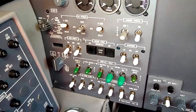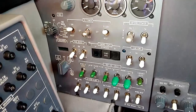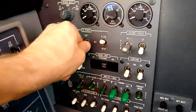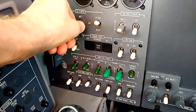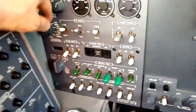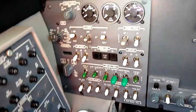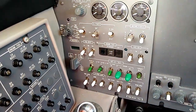That concludes the flow around the cockpit — setting up all the switches and what everything should look like for the first flight, or really at the start of any flight. After conducting that check and setup, we move to the pilot side control panel and check the emer bus. I have a separate video that goes into detail about checking the emer bus items. Then we turn the main battery master on and do a rotary test — I also have a separate video showing the details of that. That would pretty much be it for setting up the cockpit on a Citation Ultra, and the same principles apply for the entire 500-series Citation line.